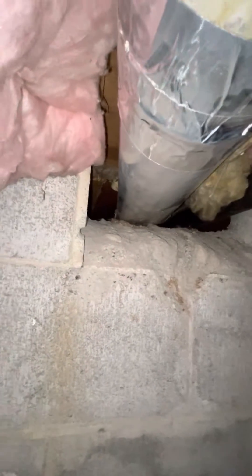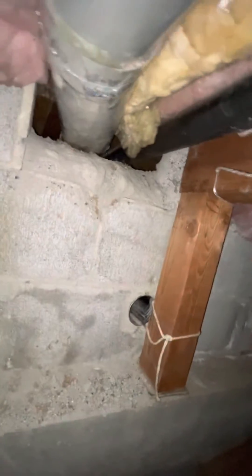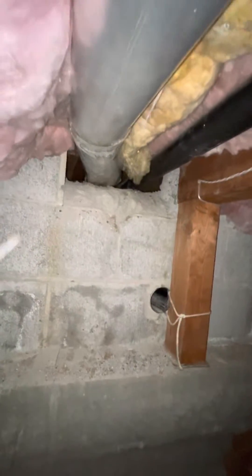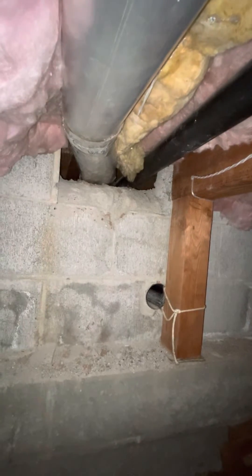That's the kind of way you often have to think about dryer vents. They're not complicated systems — it's just a pipe, basically — and it runs about 50 feet to the outside of the house. Everything else appears to be together; not the best tape job, but just take the pieces of information you have and figure out what's likely causing the issue. Sure enough, they just squished it.